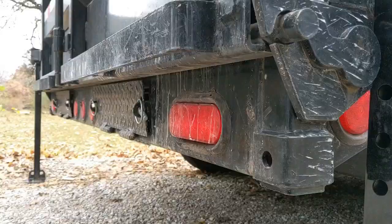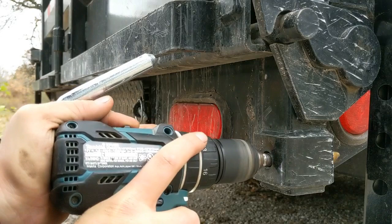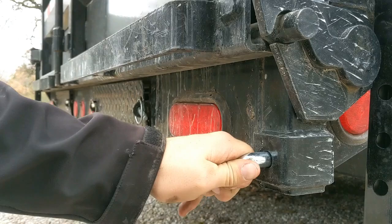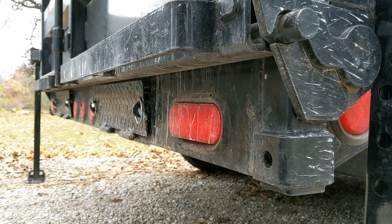Well, that's not cool. So their pin holes are not lined up, you can see. This is a little bit of a quality control issue from PJ. These holes didn't quite line up perfectly, which didn't allow these pins to go in. Didn't take much — took a half inch drill bit, opened up those holes, and the pin fit fine. And then we're going to put it in here.